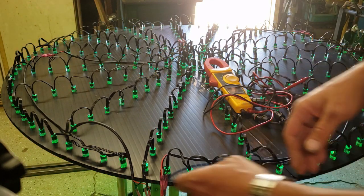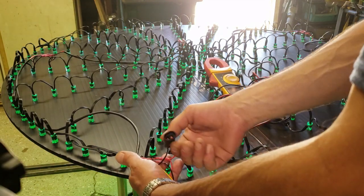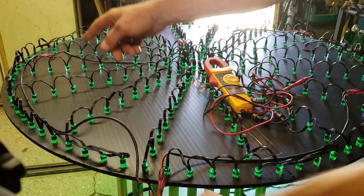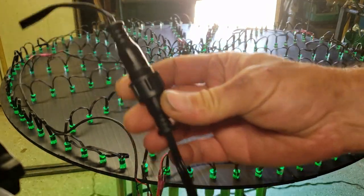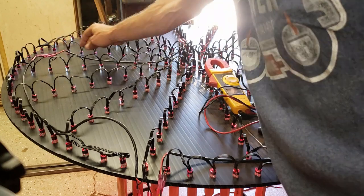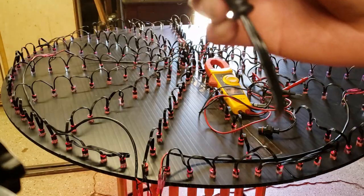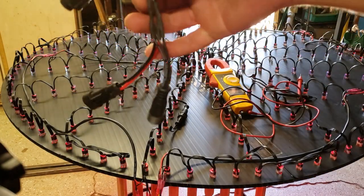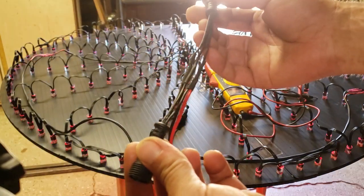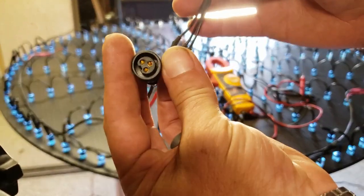Since then, I've gone ahead and wired in power injection at the very beginning and at the end for future use if I need it, and plug it off if I don't. What I did was I took 16 gauge copper two-core wire and jumped it to where all of the factory pigtails were. I cut them all out and then put the wires in, coming in and going out, and that continues every 50 pixels all the way around wherever there was originally a pigtail. I actually kept and saved these as power injection tees — a power injection point with pigtails on either end. Great for between mini trees if you have a high density mini tree, or if you're chaining props together and need to add power injection.